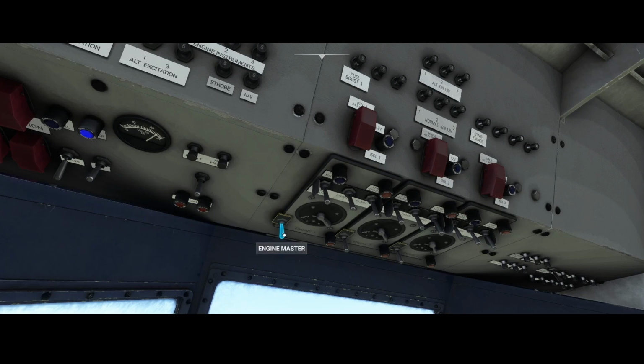It contains several important buttons. One is the engine master switch, also the ignition master switch. One is the fuel pump switch, which we need to switch on. The prime: you use it if the engine is very cold, then you can switch it on for 20 seconds and then switch it off. And the start button to start the engine. The magneto is below that. The magneto needs to be switched to both if you want to make sure that the engine starts.